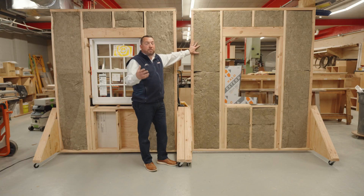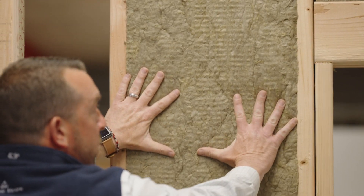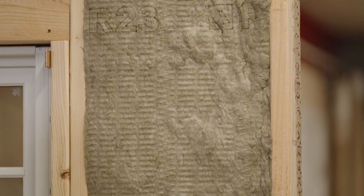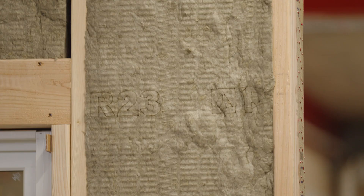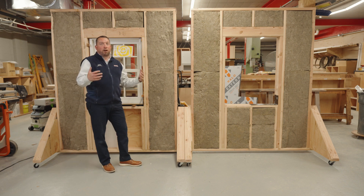There are some really great qualities about Rockwool. It has great sound deadening quality and is not affected by moisture. It's not a batted insulation — it's a pressure fit insulation to hold it into the wall itself. You get great extended R-value over traditional insulation products, and it's easier to work with. You don't have to shut down your job site like you would with closed cell spray foam; you can continue to work without leaving the job site for 48 hours. Rockwool gives you a wide variety of R-values and an opportunity to build a high-performing wall cavity and exceed R-value codes, especially with today's new code changes.